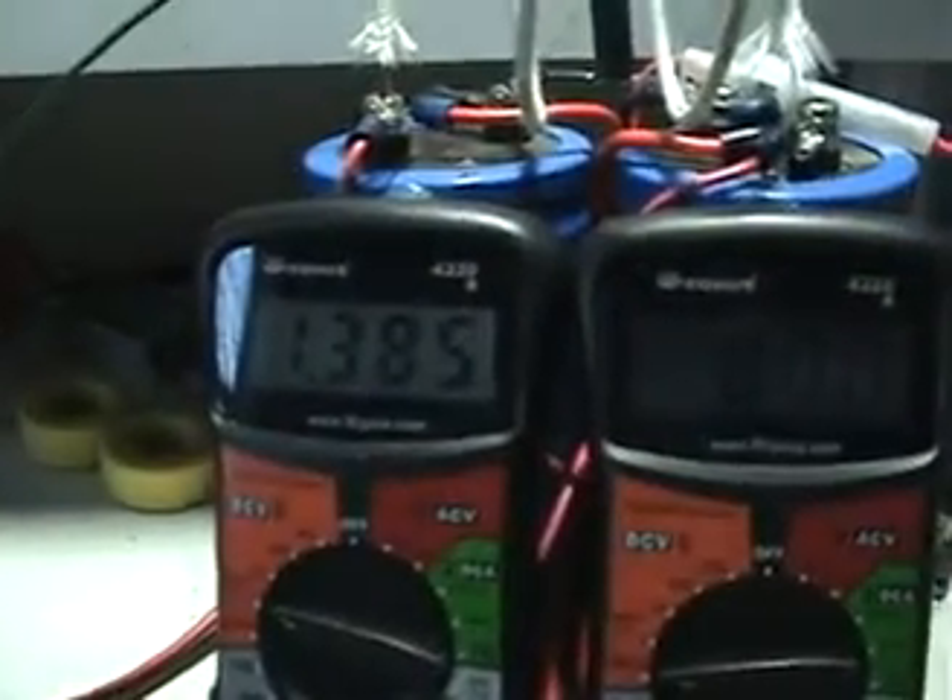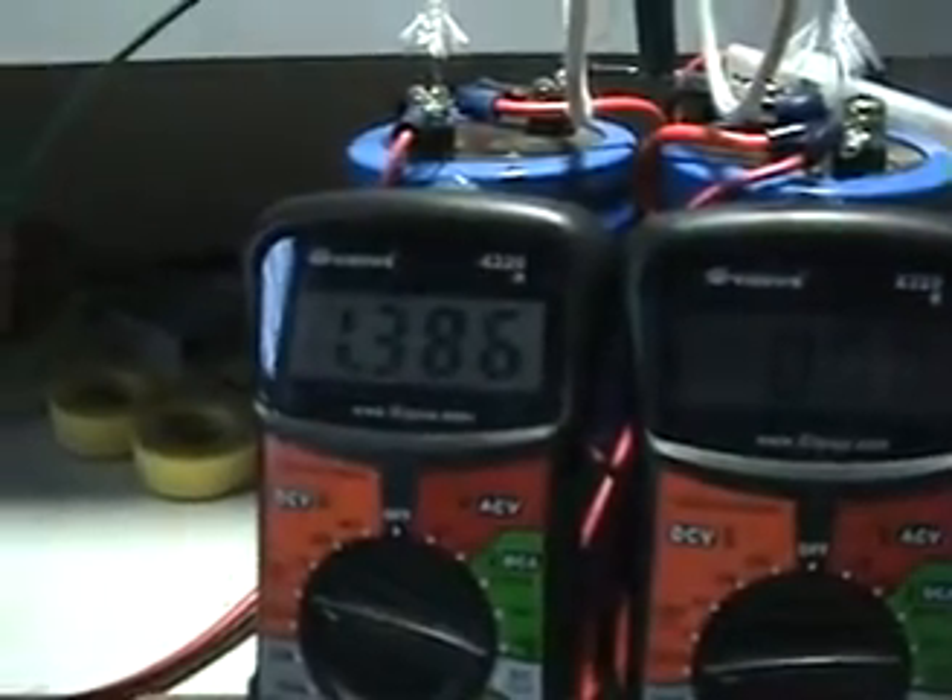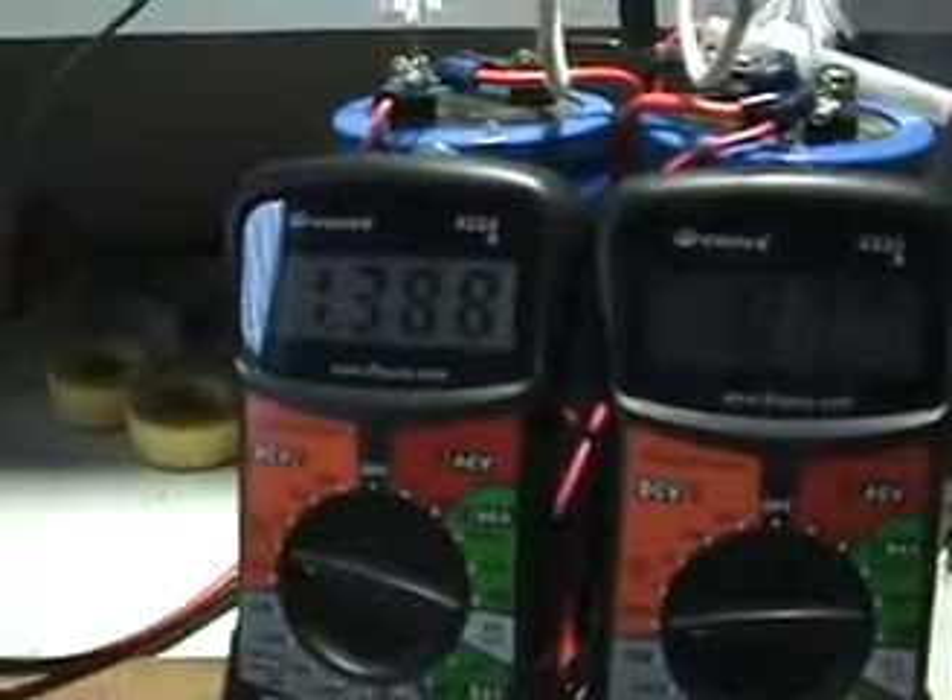It takes a very small change — even less than what I just demonstrated. I'll pull that capacitor back out, and now we see a recovery. So both frequency and duty cycle are very sensitive and important parameters to get this reverse energy effect happening. All this time the battery has been disconnected.